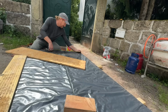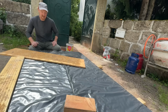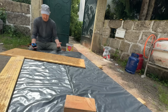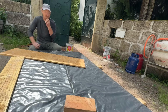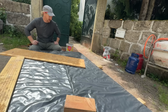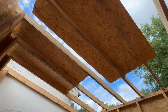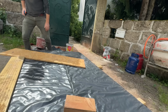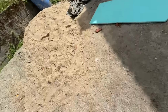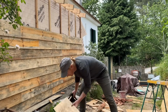Underneath this plastic is a whole bunch of plasterboard. Yeah, 120. So we've got the choice. We either make it easy for the plasterboard to go up onto those beams by making the 120 work and fit, or we make it 125 for the board on top and make it easy for that. But I think we'll stick with the 120 because that's what I designed the beam supports to be. Means cutting all the boards. So last.